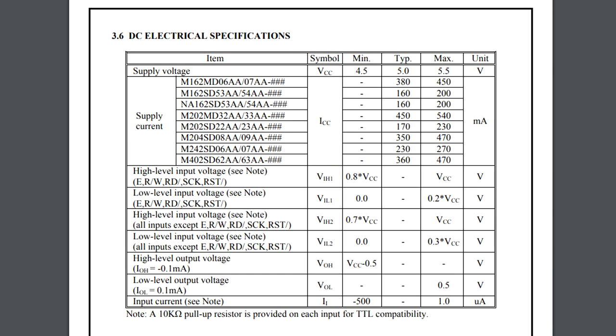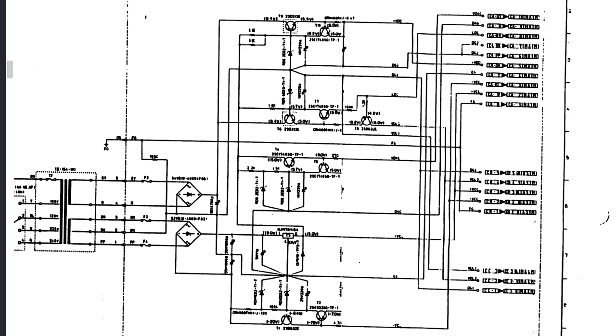The VFD uses 200 milliamps, a whole watt. Due to how the power supply works, this means you're going to be dissipating a couple more watts as heat through the D313 power transistor that drives this rail. And if it can't take this over a long period of time, it'll burn up, and it might fail short circuits.